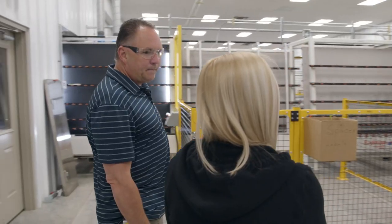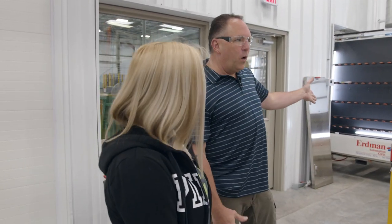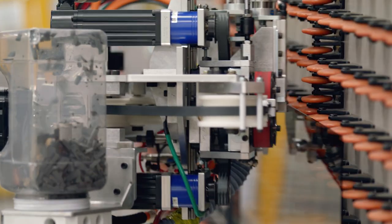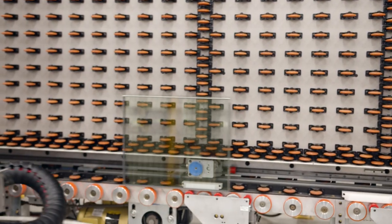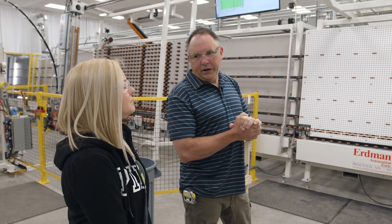So what's happening on this long line? After it comes out of the washer, if we'd have any issues, that's just an inspection area. But then when we come down here, this is where it gets the spacer put on it, depending on the size of the window and what the customer has ordered. The next area it goes down to is our press and our gas machine.